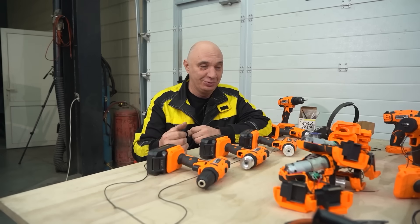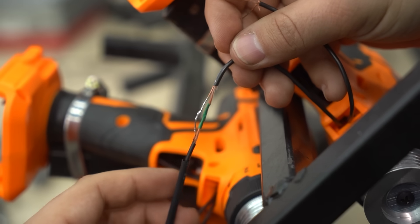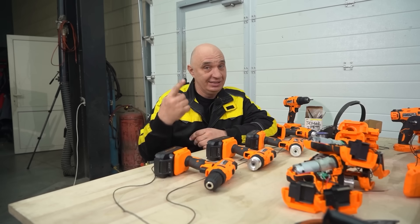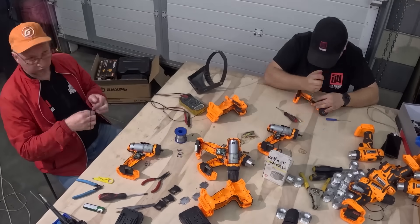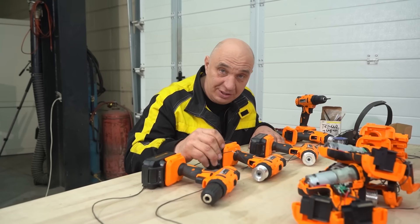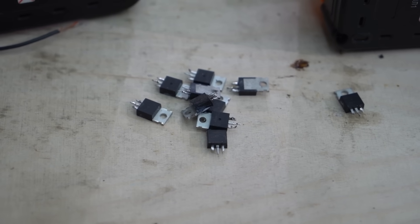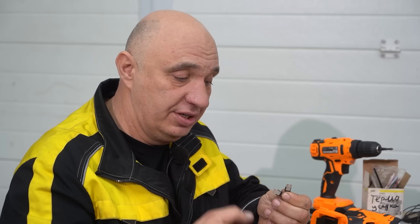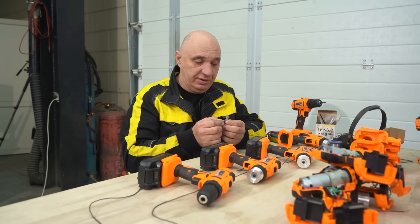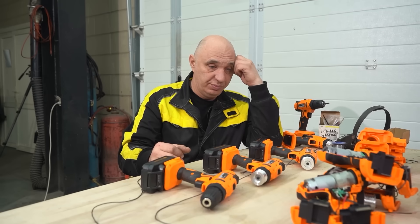Back to the screwdrivers, and this has gotten a bit interesting. We've got 50 units and we're trying to figure out how to get them to work smoothly from the push of a button — a single button to control all 50. We've been working on a system and testing it for a good week. In the beginning we were using regular wires; now we've switched to screened wires. We've also been replacing these transistors because for whatever reason, when one is on the chip by itself it works just fine, but once we start tying all of this into a bundle, they just keep failing.